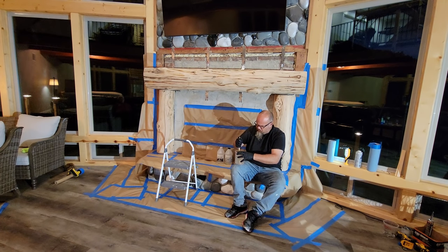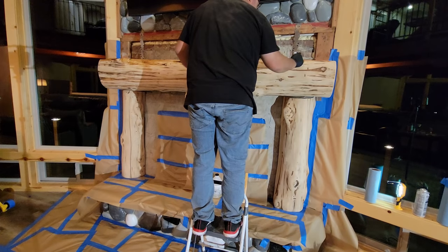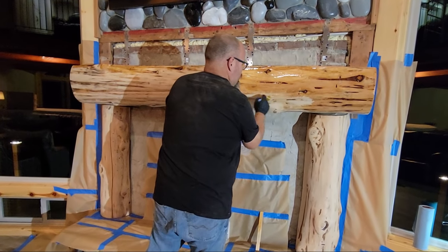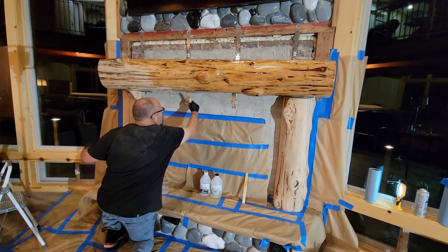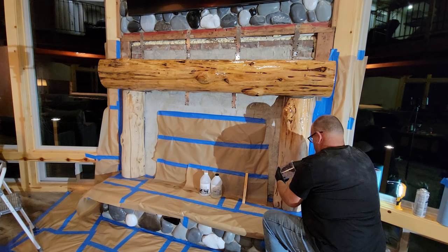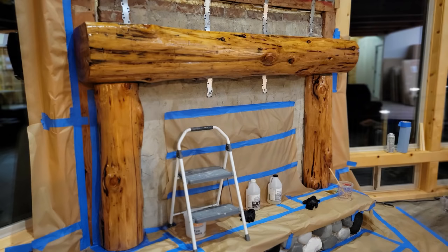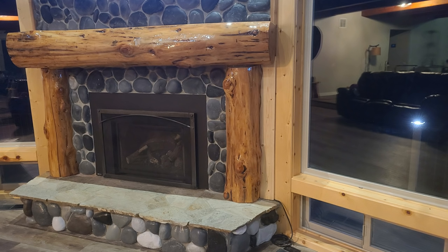By working into the night, I was able to get this project done in a day, and Quick Coat was the answer. Because this is a vertical project that's already installed, gravity is going to fight the epoxy, so I'm using Stone Coat Quick Coat. It's not continually self-leveling, so I was able to brush it on. I did two coats using a brush and my gloved hands to apply it. It dried in about 30 minutes — though that will vary depending on humidity and temperature. I needed two coats to really seal this wood, and it looked like a Grand River Lodge.